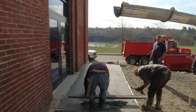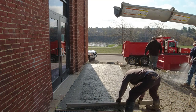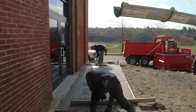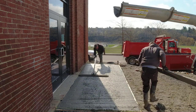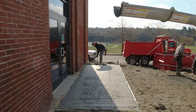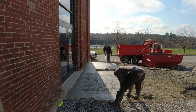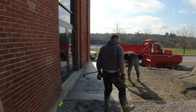This has an inch slope from the building out to that outside board, which in six feet an inch is going to be plenty enough just to help shed the water. We tend to do a lot of these little entry slabs or patio slabs in a year — it's what most people do to their entrances up here in Maine, whether it's for a retail place like this, a gas station, a school, or even a house.